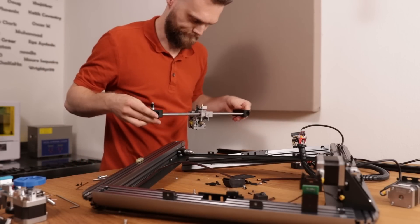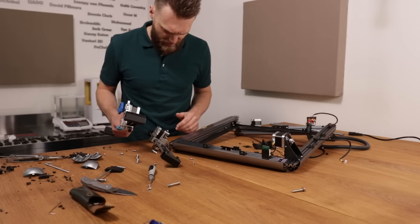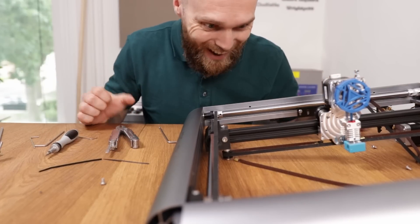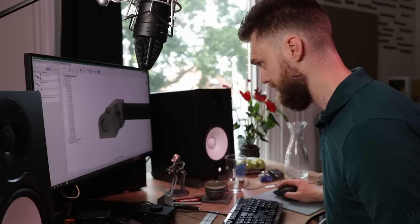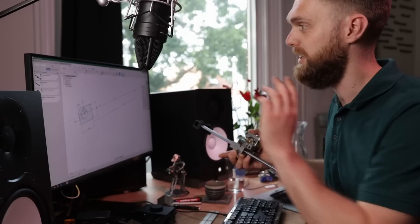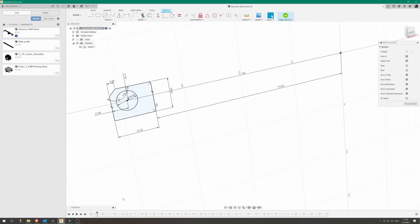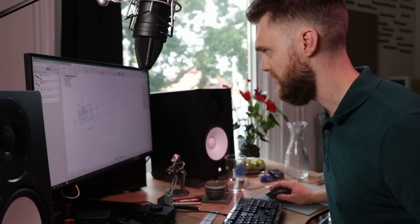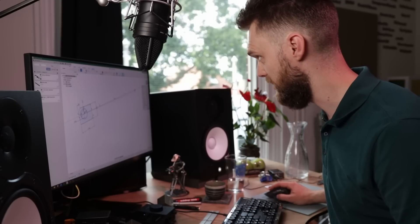I've made this design, which I'm quite pleased with. This is not my first iteration — I accidentally made a mirror image on the first one. I'm going to show you quickly what I've done. I started out pretty simple with this shape. Because this original gantry is symmetric, I've made a sketch left from the origin so I can use the origin as a mirror plane. Before I start with a design, I always ask myself: is there anything symmetric and are there any important measurements? In hindsight, I should have just dimensioned the center distance.